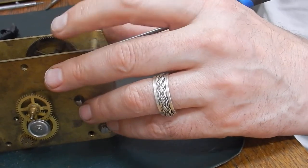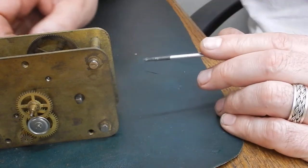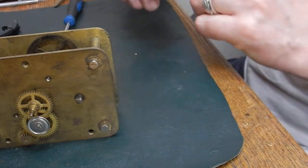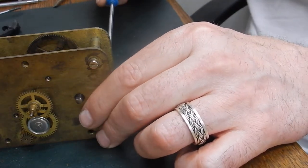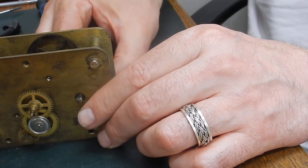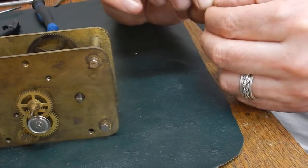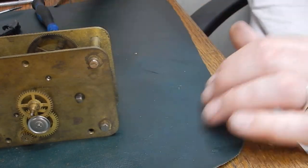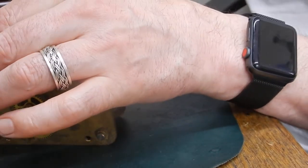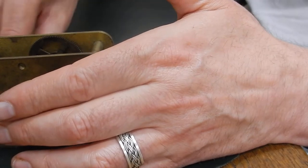There are other ways — you could keep hold of the pillar with soft-nose pliers but you can't always get a grip on it. That seemed to do the job. After that, if you really needed to, you could run a tap through it and re-thread it that way, clean it up. But yeah, everything else seems to be pretty easy.